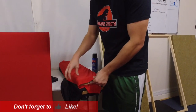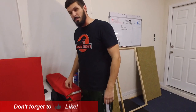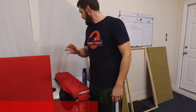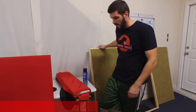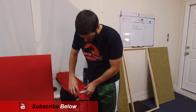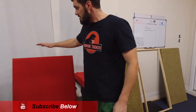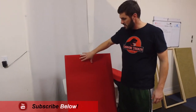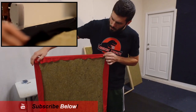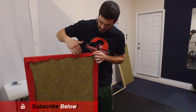Once you've got that framed panel, you'll want to pick out a breathable material. By breathable, I mean if you put this over your head, are you able to breathe through it? Something like vinyl will not allow sound waves to penetrate it, which would not allow the insulation panel to absorb the sound wave. The fabric we found at a local fabric store is 100% polyester — it's stretchy and looks really good. We have the finished panel here, covered with the fabric, and on the back we just stapled it to the frame.